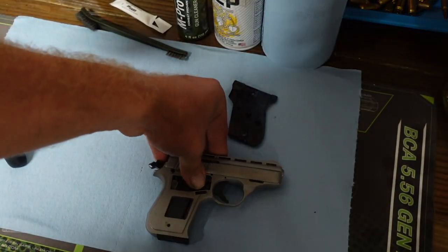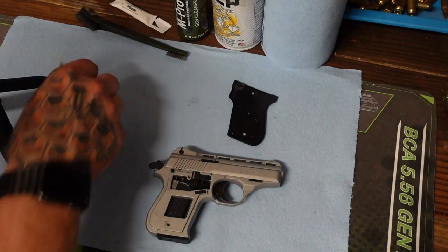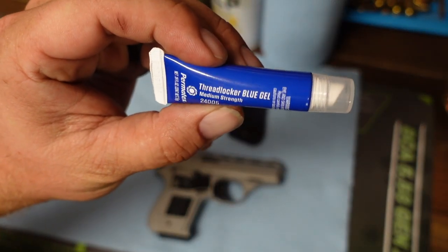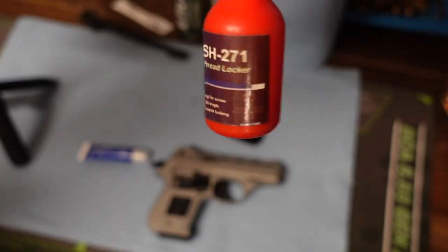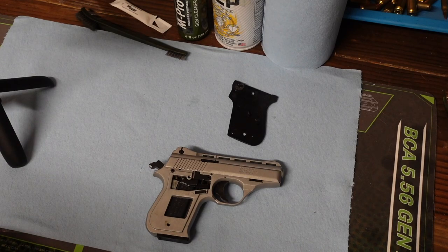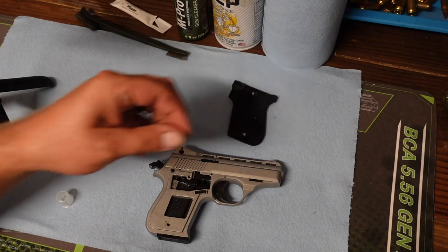So like I said, this may be the simplest fix. For me, I decided pretty simply that I'm going to go ahead and use some thread locker — some blue thread locker. Because those came loose on their own, and I wouldn't recommend using red, because you'll probably never get it back off. But just a tiny dab of the blue thread locker should be more than enough.